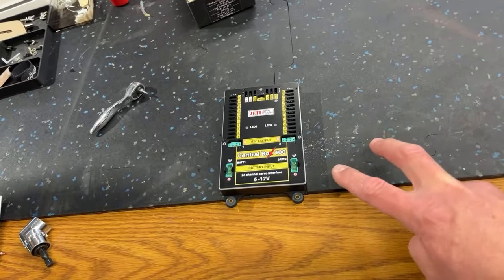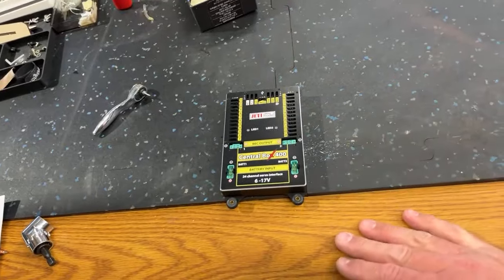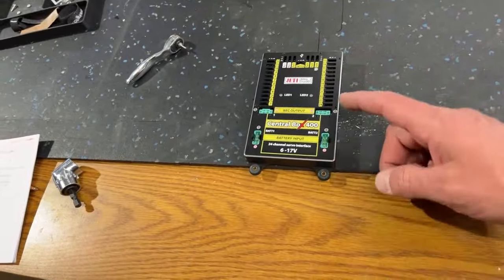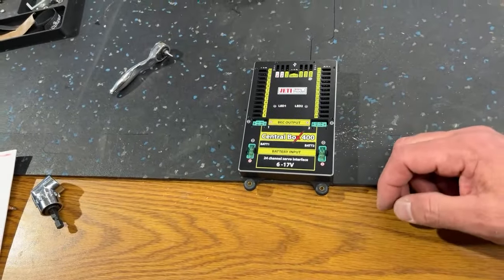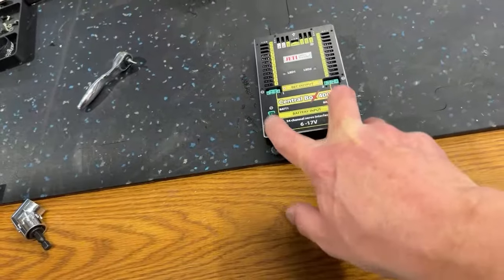And the flight number two, you're gonna be whatever, 8 volts. So you're losing power, right? The central box 400 and the 300 series, you can use a three cell LiPo. The 400 here, you can use a four cell LiPo, and you can regulate the outputs. So that's why we're changing this, is we're putting three cell LiPo batteries in here.